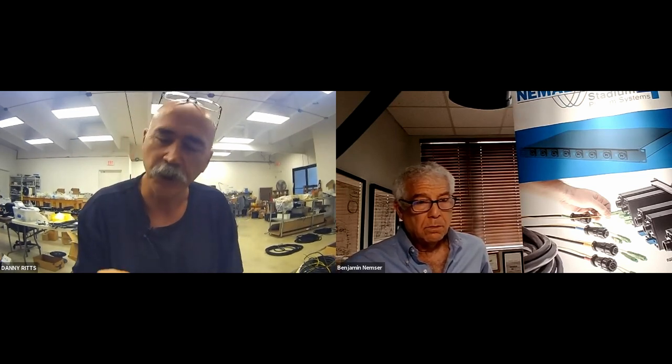When it comes to glass, if it's a good connector, it's 100% to 100 gig. That's been my personal experience. I haven't had to go back and goose them along and improve their appearance just to buy a couple of tenths of a dB to get the performance. It was either there or it's not.